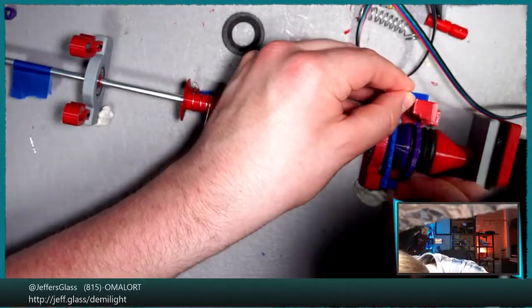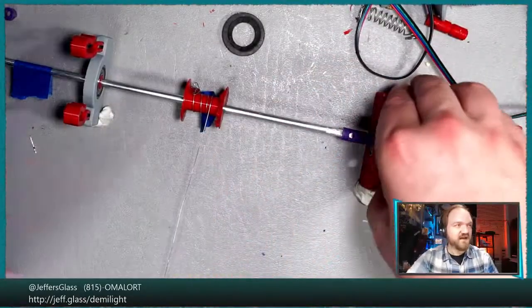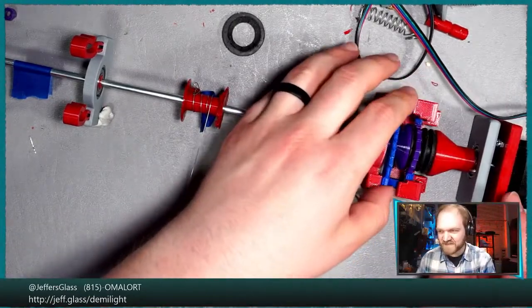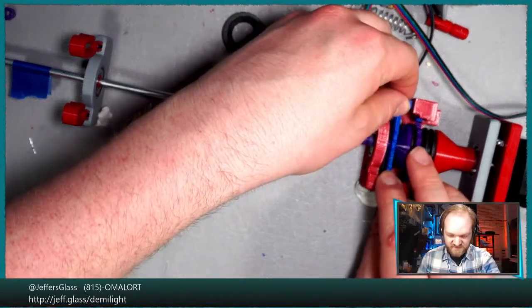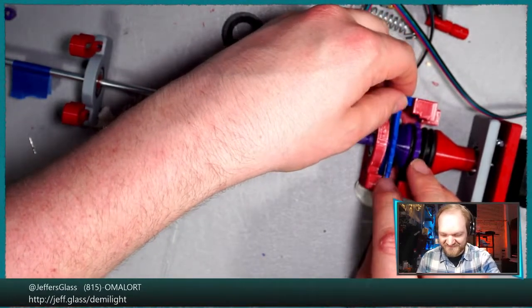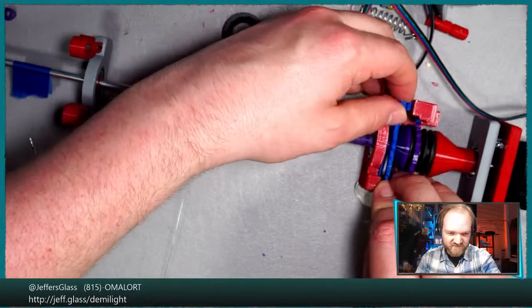So you're going to see a lovely view of my hairline, which is great as I get in real close to see. There we go. I'll get that out of the way. Okay, so now let me turn the stepper power off. Yeah, I could feel that settle back down onto the ratchet. That's fascinating. If I were to remove this ratchet, would this fall? No. So something in the system, some friction, is causing this not to lower on its own.